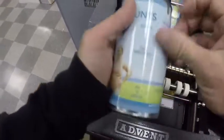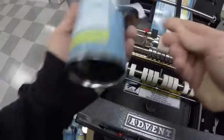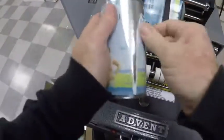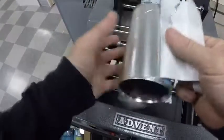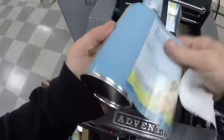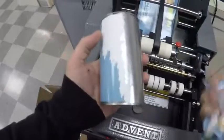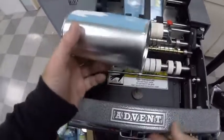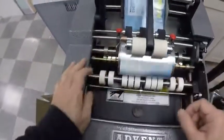And just to show you the skip glue pattern — you can see you can tear this label off. It's on there very securely. There's the trailing edge and there's the leading edge. You can see it has good fiber tear. Just excellent.